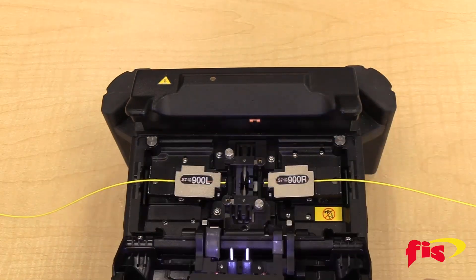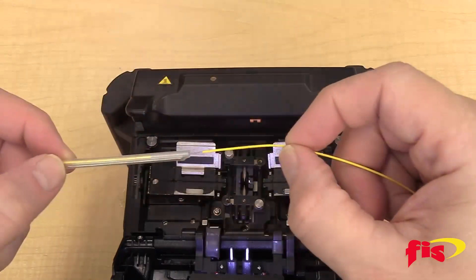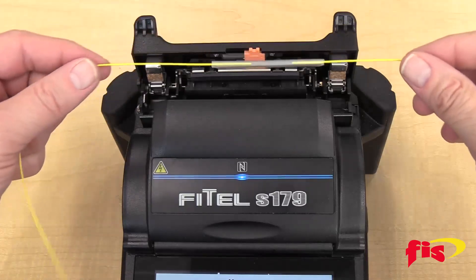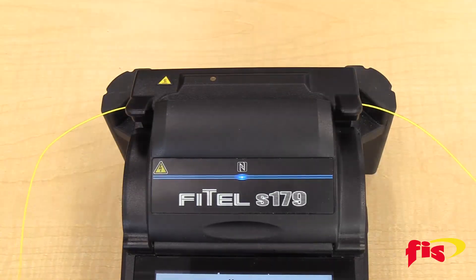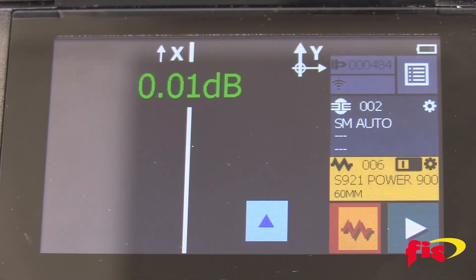Open the lid and carefully open the fiber clamps and move the splice sleeve to the exposed splice. Open the onboard oven lid and lay the fiber in the center. The oven will melt down the splice sleeve to offer protection. The splice sleeve protects the splice in two ways: one, the strength member inside provides rigidity since the jacket has been stripped, and two, the compound inside seals the exposed glass from the outside environment. The oven will go through a cooling cycle and an audible beep to let you know when it's done.